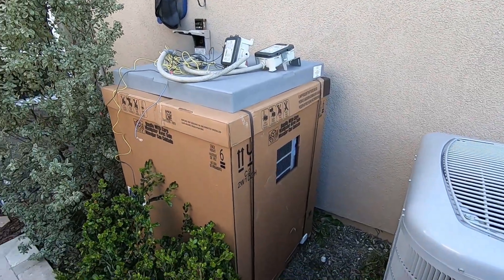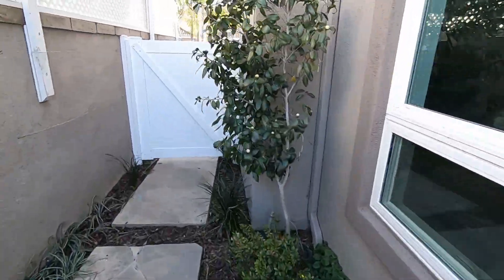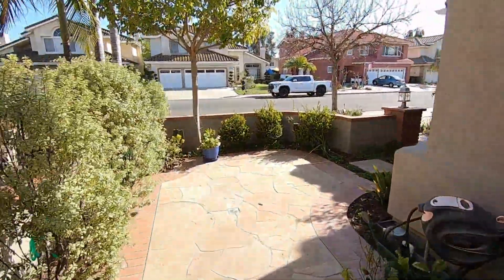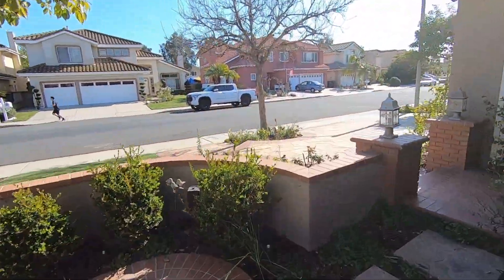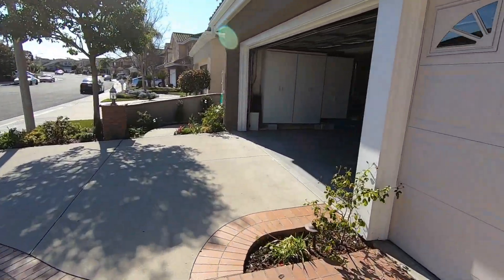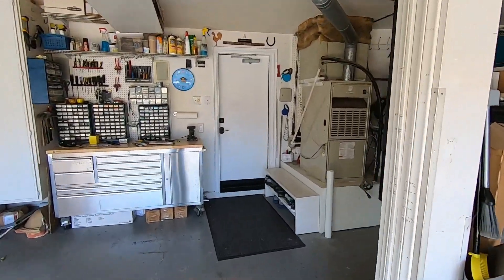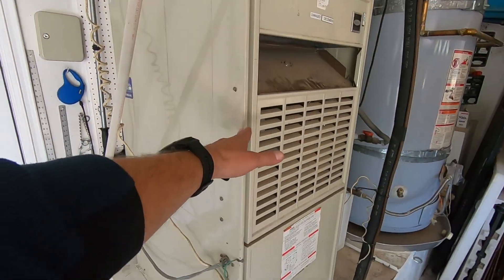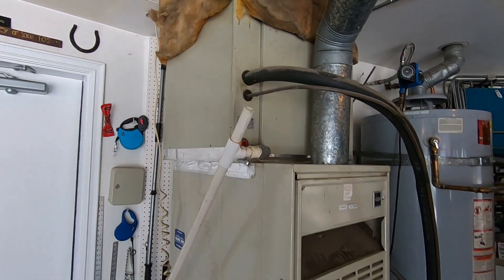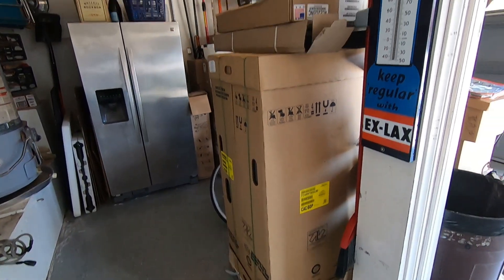On Monday, we're going to come back and do this unit. I'm going to take you over to the garage to show you what we're going to do. In this garage, we have your traditional gas furnace right here and your traditional evaporator coil, which was matched with an AC condenser outside. So what we're going to do is put this Carrier fan coil right here.